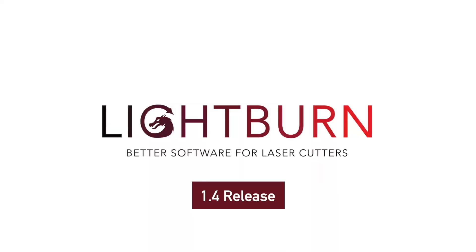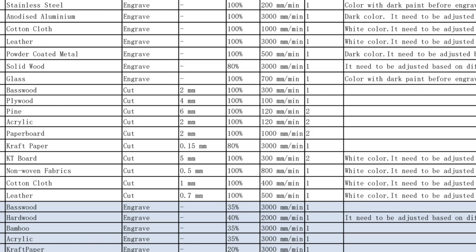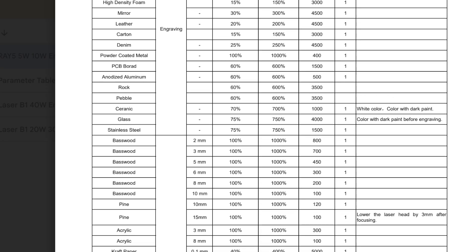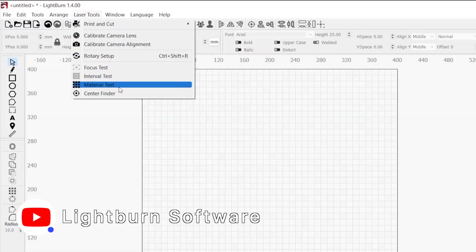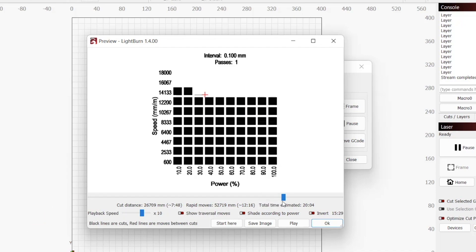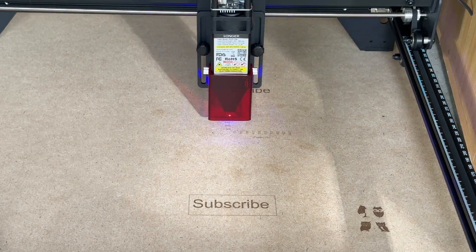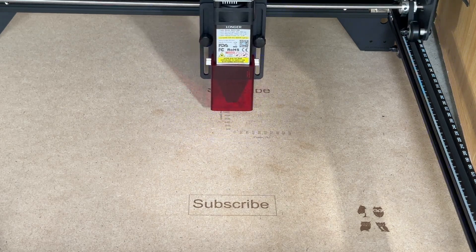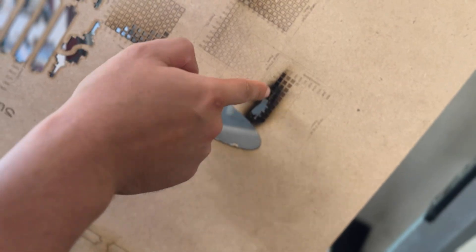For the slicing or G-code software, I'm using Lightburn — they had a 30-day trial, so I'll have to work out what I'm going to do when that runs out. Your machine should have a reference sheet for settings to use for different materials, and even if you have that, it's still a good starting point because machines and materials vary. In Lightburn, you can generate a materials test that does a grid testing two parameters — usually speed and power. You want to do a cut test and an etch test. From those results, you can pick the optimal settings for your desired result. Just be careful when setting up the test, particularly for the engraving etch test — do not have any settings go to 100% power, because that's how I burnt a hole in my MDF sheet. Look at that — I've burnt a hole through the sheet.